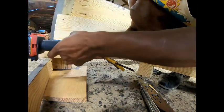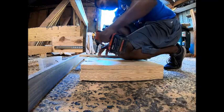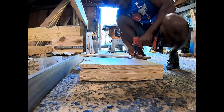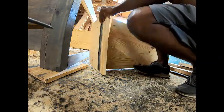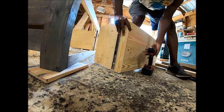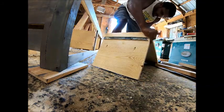The easiest way I've found: I have a little scrap block held by a clamp — all my drawer slides are set at this exact height of about two and a half inches, just so everything stays exactly the same. Use the screws that came with the drawer slides — I'll link those below. Attach two per drawer, then use that same scrap block again so there's no measuring needed. Attach the other part of the drawer slide, then slide all four pieces in, pull two out per drawer, and measure the distance in between to get the length for the connecting piece. Pocket hole that together, test slide it in to confirm fit.